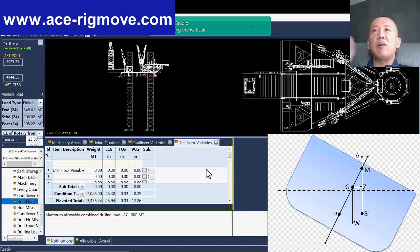And you ask yourself, is this standard practice that we secure something so heavy by just wrapping around the tugger wire and it's safe? That's not possible, right? How can a tugger wire hold 5 stands of drill pipe? No way, no way you can hold it. It's best to lay down everything and put it on deck.